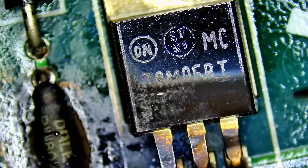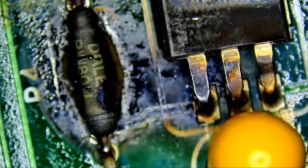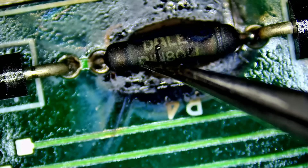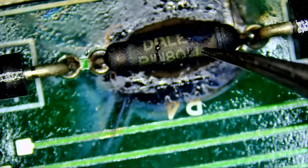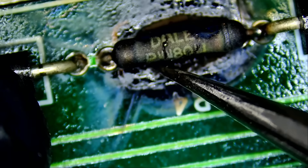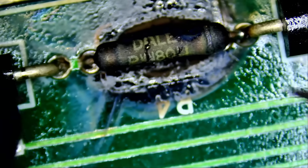We got the right chip shape but the wrong resistor. What is the value of the resistor? I have the model number but that alone is not enough — we need the value. If you search online you can find the same model but still need the value. The bottom of the number should show it but we cannot read it. Without schematics or board view diagrams, how can we replace it? You have to use your head.